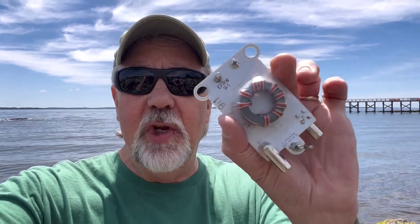What I'm gonna do today is build one of my favorite antennas — a vertical half-wave for the 20-meter band — so roughly about a 33-foot piece of wire, and check SWR. Then I'll take it down, chop about four feet off, and make it a 29-foot random wire antenna vertical. This is Rocky Point State Park on Narragansett Bay here in Rhode Island. I'll be operating as K4OGO stroke Whiskey One. Stick around.